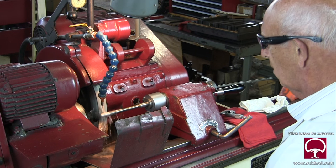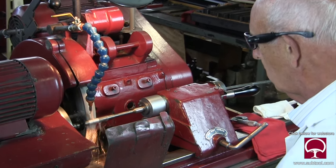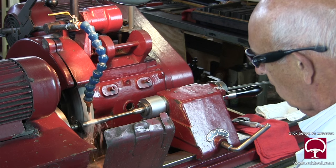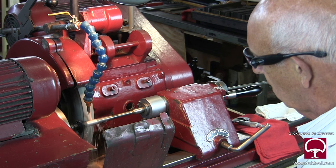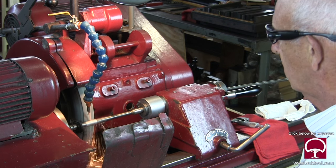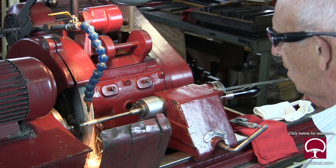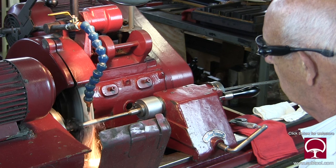When we put this tool to work, I'm going to show you why concentricity is important. I'm going to take a cut here. What I did was I fed in all the way — it looks like it's going to take about 12 thousandths to clean it up. I fed in all 12 thousandths and walk across nice and slow, so I let the wheel on the edge do the cutting, which is my philosophy.